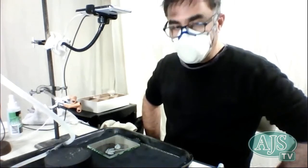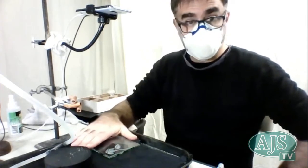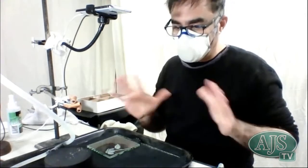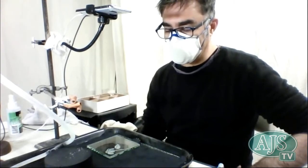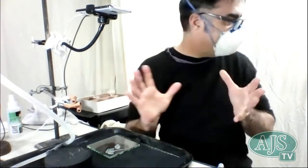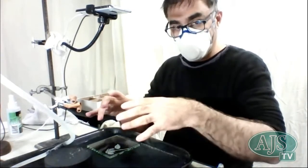Look, acid etching is a wonderful way to get a really nice finish, particularly if you're working with lead crystal. This is just float glass here today. You can get beautiful soft finishes with acid etching, absolutely. And I know you can buy little kits that'll do it for you. What I actually prefer when I work on larger pieces, I don't have any to hand down here, is sandblasting.